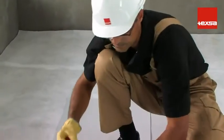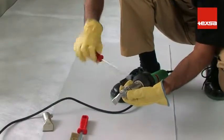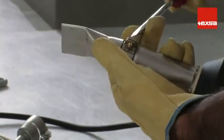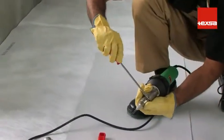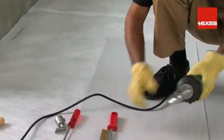Joints. Preparing the handheld equipment. Adherence between synthetic membranes is achieved by using hot air or solvents, never with adhesives. There are specific sizes and shapes for completing the finishing details. For longitudinal and transversal joints, straight 40 millimeter nozzles are the most appropriate.